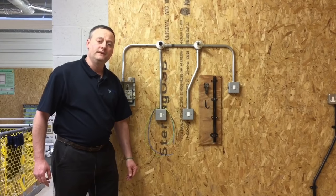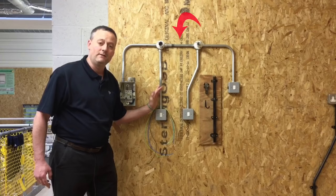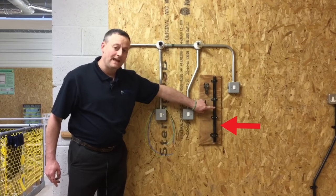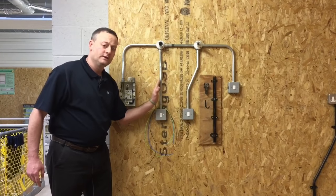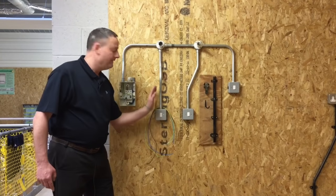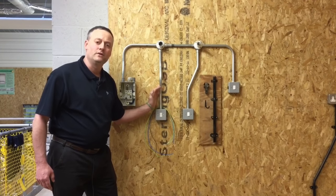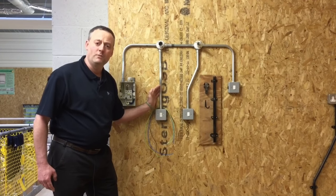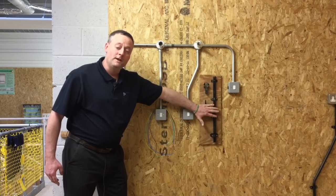Metal conduit comes in two common finishes. The one we installed here for our lighting circuit is zinc galvanized, and there's also black enamel, which is not as often used now. The exam will ask us why we'd select one conduit system over another — for a damp situation or outside, we'd use galvanized conduit because it doesn't corrode. For inside with strong mechanical protection, the exam may require us to select black enamel — steel pipe covered in black gloss paint.